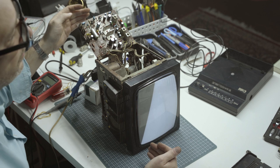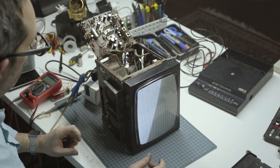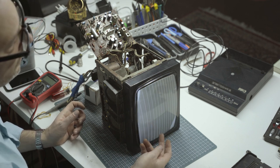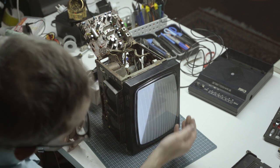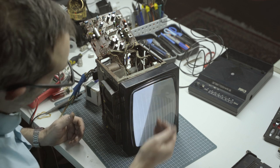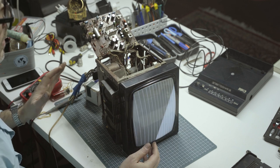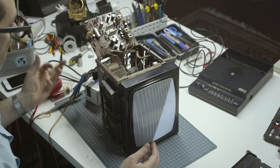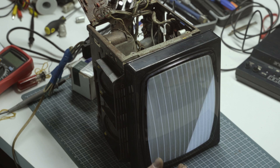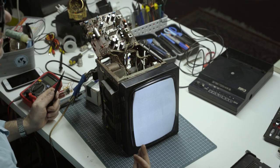After metering all the pins on these ICs and backtracking, I played with a couple of the potentiometers — and look what we've got: raster! This bar here is from the camera, but in reality it's flashing quite a bit. We have some sort of image, which is huge progress from a white horizontal line. Being a total amateur makes me really nervous to poke around inside televisions while they're turned on, so I've just been playing with the potentiometers. This is progress.